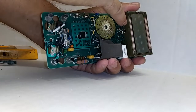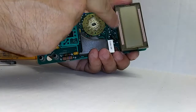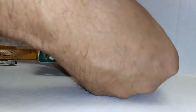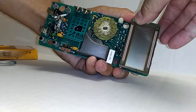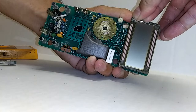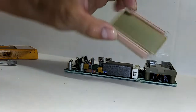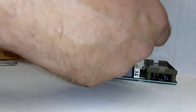The face mask has posts around the edges on the bracket that it snaps over. And now we see the old pink elastomers inside here underneath the LCD. I am going to remove this LCD along with the pink elastomers. It's going to be — you can hear it unsticking. This is perfectly normal; older elastomers kind of get stuck in place on these LCDs.